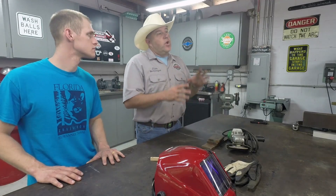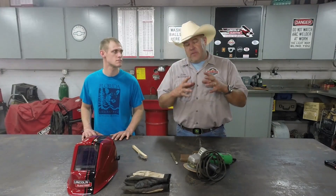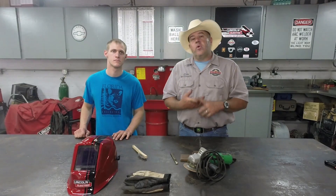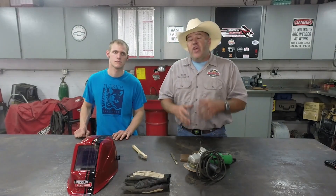We're also going to need to clean that aluminum with an aluminum-approved grinding wheel, cleaning an area all the way around where we're going to weld, because we don't want to breathe the paint and coating materials when they melt and get really hot. We're also going to clean the aluminum with acetone. Acetone is used because it evaporates quickly and doesn't leave any grease behind. It also dissolves most of the paint. In aluminum, they use a two-part acid etching primer that we absolutely have to make sure we get all of off.